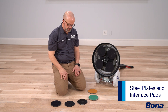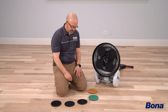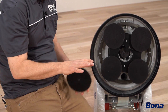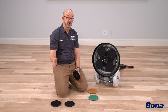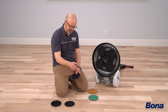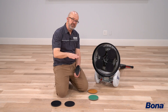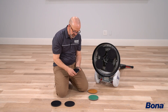The last best practice for today revolves around steel plates and intermediate pads - where do I use them and why are they useful? I highly recommend getting at least a set of steel plates and being prepared to use them in your system. They're going to keep the floor completely flat. If you did your first sanding with a belt or drum sander and you've got a little chatter in the floor, the steel plates are going to help get that chatter out. Whereas if you only use the drive pads, they may follow the chatter a little bit - it may look like it takes it out, but it won't.